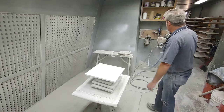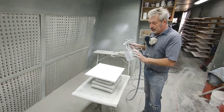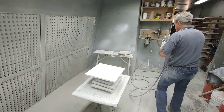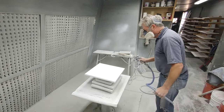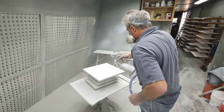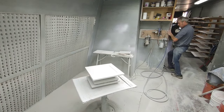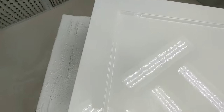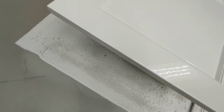This is using an HVLP system. I prefer to use this because I use multiple colors all the time. I bought the best unit I could and it goes really fast. Come take a look at that — right there is what you want. That's called a full wet coat, and you can see there are no hang-ups anywhere on here.